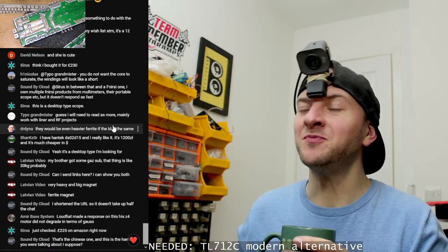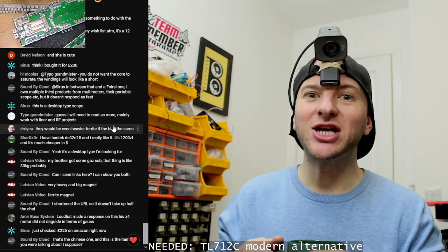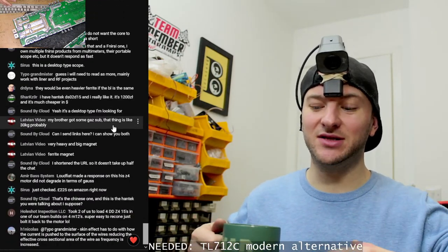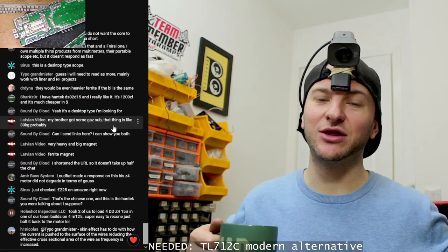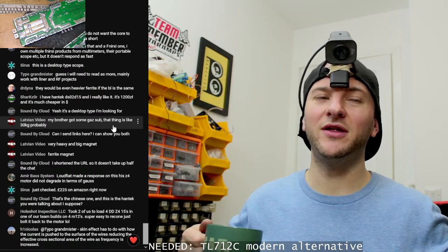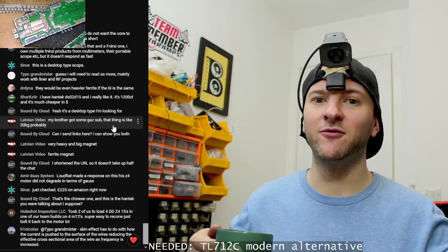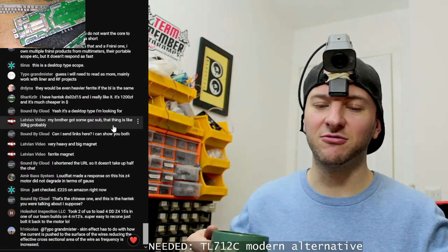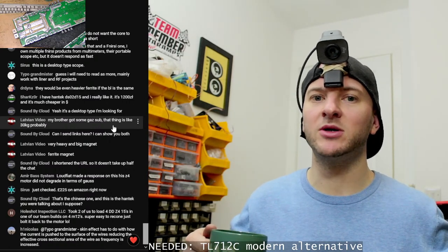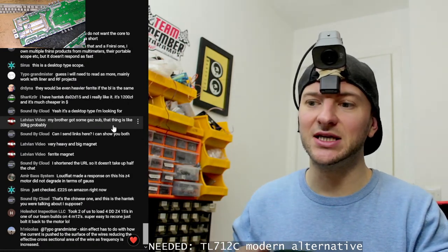They would be even heavier. So basically, that's a funny one. Digital Designs, DD in Oklahoma, actually have a ferrite motor that has the same flux density as one of their older Z3 motors. They either built the ferrite motor first, just to see what kind of TS parameters and performance they get from a motor like the Z3, or they built the ferrite motor afterwards just in an experiment to see whether they could get a ferrite motor up to the same flux density as the Neo motor.